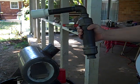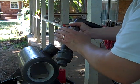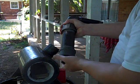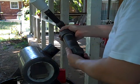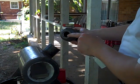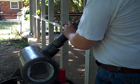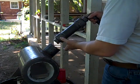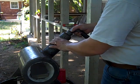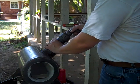This is the fix. This is Schedule 40 iron pipe, heavy duty stuff, and I haven't put any pipe dope on any of these threads because I got to take some pieces apart, but this is how it's going to work. This is now the outlet. Instead of 3 inches in diameter, 1 inch in diameter. This is going to fit down in here, and this part fits nice. I'm going to put some set screws around here to hold this in place, and I'll be able to adjust a little bit here and there if I want to.